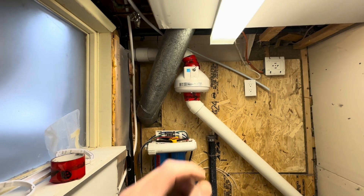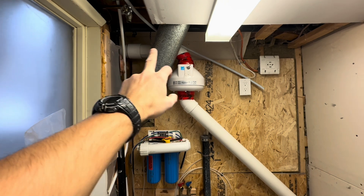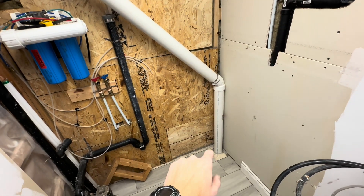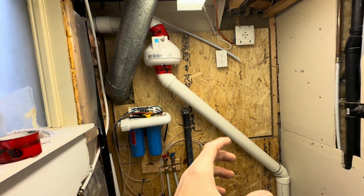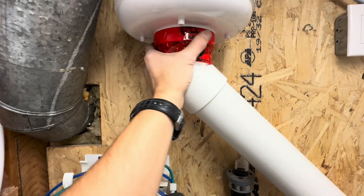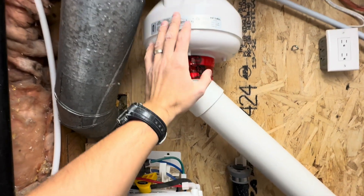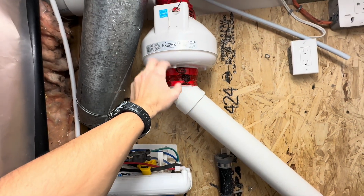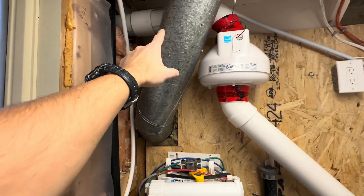We've cut a four-inch hole in the slab and I hand-dug about six inches of gravel — I'll go all the way until I hit dirt. We've got our radon fan right here that still needs to be wired in. There's three-inch PVC that runs all the way down into the slab — you want to minimize elbows as much as you can since they add resistance to airflow. I ended up MacGyvering a connection here since the pipe didn't fit perfectly, but it needs to be serviceable anyway so we didn't glue it. This exhausts right to the exterior and I've got a special louver out there.